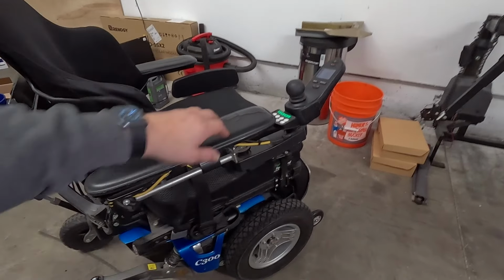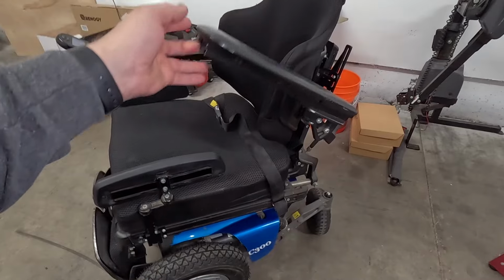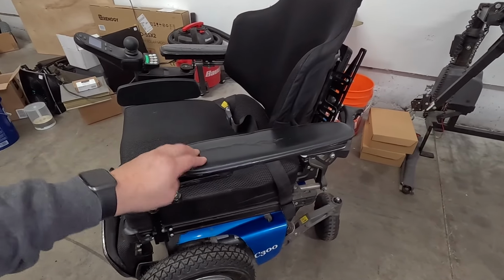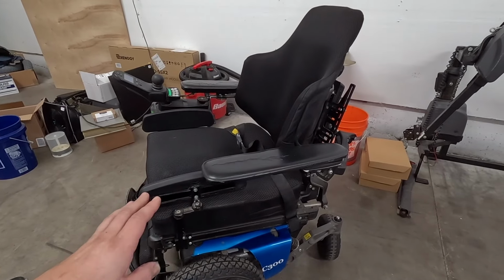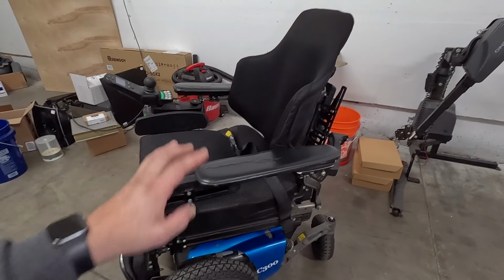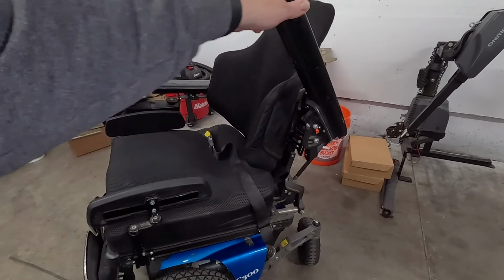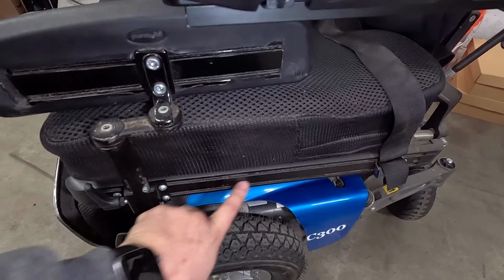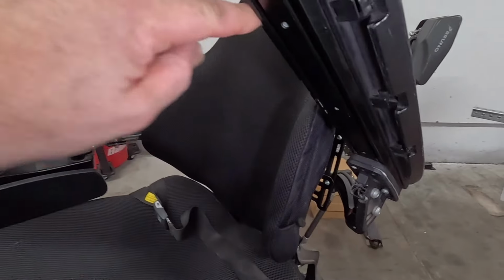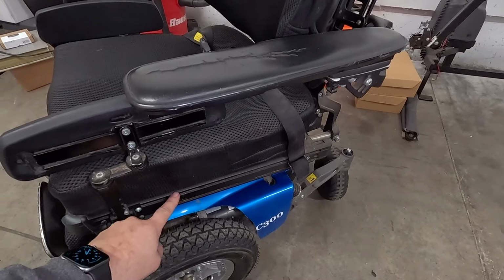The other thing I wanna do, since this chair has cantilevered armrests, is install some brackets so that I can basically fix these in the down position. When they're moving around power chairs, they just grab it anywhere and try to pick the thing up. So they might try to grab it here and lift this and bend it or something. So I think I wanna put some brackets down here, and also on this rail underneath here, and then I can use some straps to tie these down.